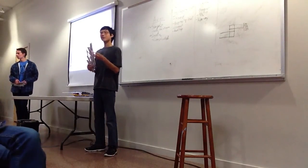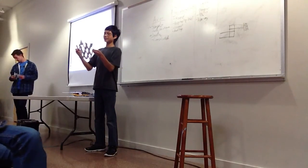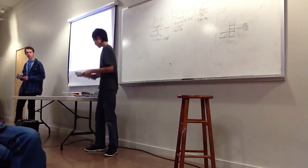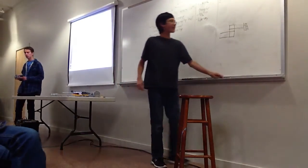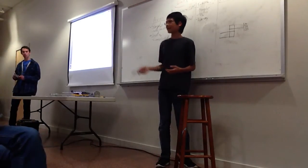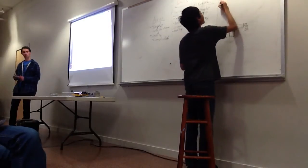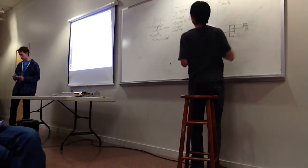And then it goes through this huge gear train and back to a motor. A motor turns it and it just rotates this one here, which rotates the whole arm up. This can vary in size. That's a pretty big one, but you can just have simple linkages like this, where it's just short. This year you don't need to go that high. Last year we had to get up pretty high. But bar linkages are mostly simple. The hardest part with these things is the gear train.